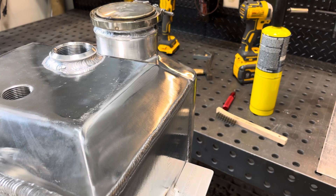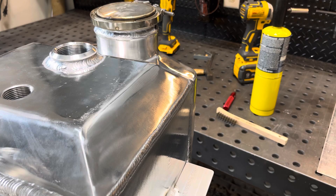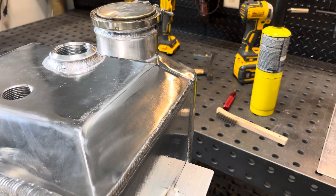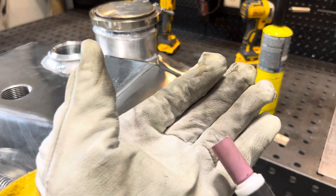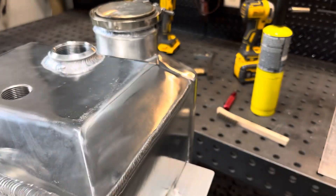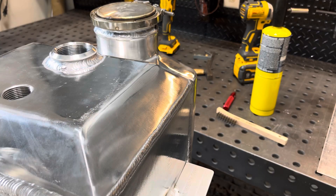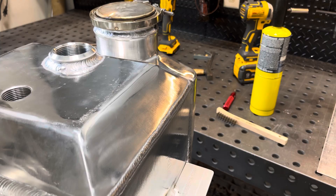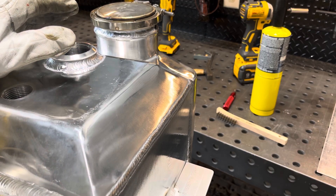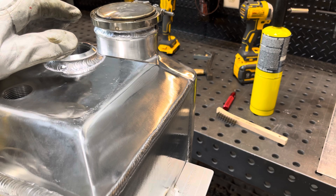While we're waiting on that to cool, I'm going to go over my welder settings with you guys. Everything is about the same as I always do. I sharpened the tungsten and got a real nice small ball on it. Number six cup, like I always run, about 22 CFH. I ran the balance a little bit higher — about 33% balance on the Prime Weld machine.